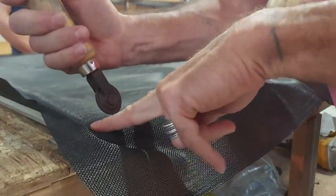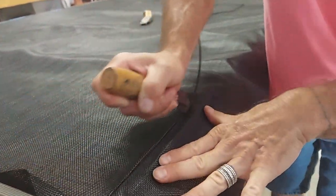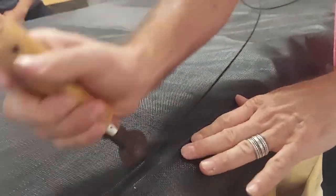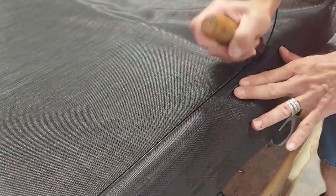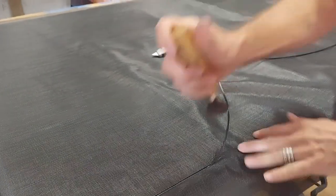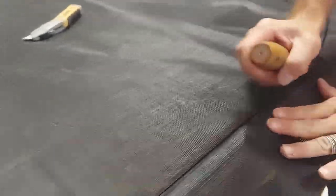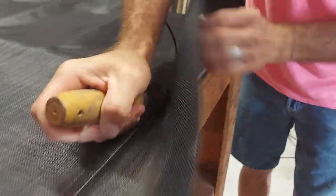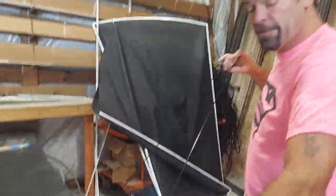So here we are, we're going to go ahead and finish this up. Like I've preached so many times in other videos, on this side, instead of dragging your hand, pull your hand out. The reason is we're just going to make sure that every one of these is tight — we want no wrinkles in our material. Making sure each one of those is good. We don't want to over-tighten it because then it will bow out. I am a perfectionist when it comes to colonial because it's a very expensive product. As you can see, it's taking extra time.